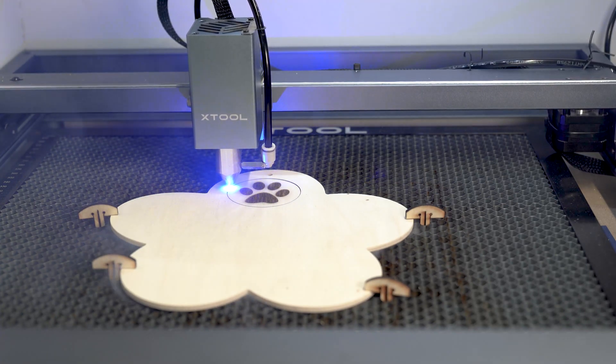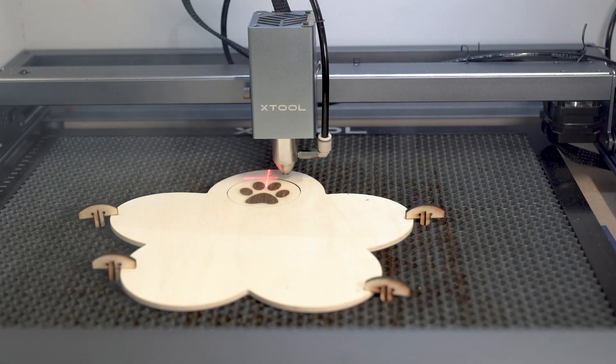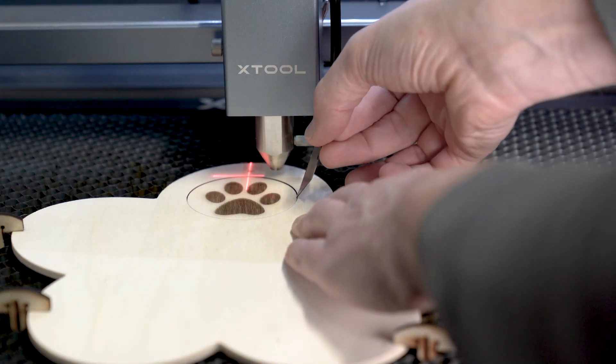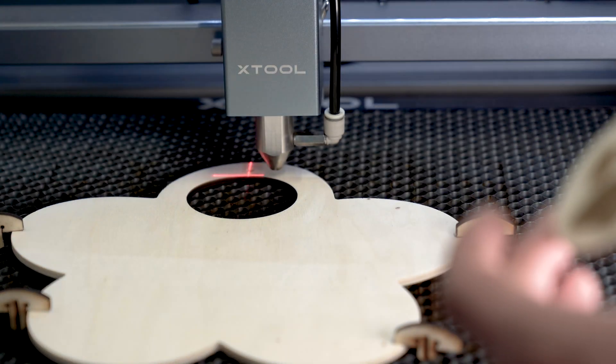There are some spots we can see, especially on the left-hand side — we can see smoke coming out, which is a good indication that we are cutting all the way through. Our project is complete. I like to use a small screwdriver or sometimes a razor blade to pick out the piece of work, and the reason I do that without removing the main board is that if it didn't cut all the way through I can rerun the program and just do the cutout again. Thank you for watching today's video — I hope your project came out as well as mine did. If you have any questions, please leave a comment down below and we'll get that answered for you. Until next time: be safe, be creative, and have fun.